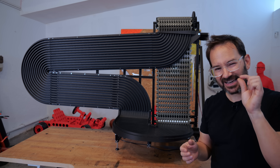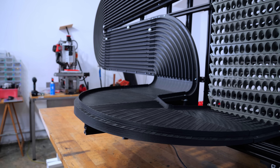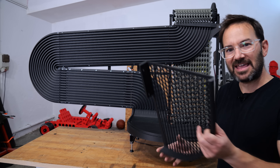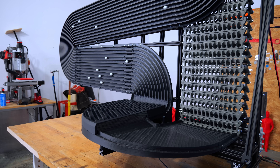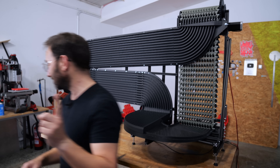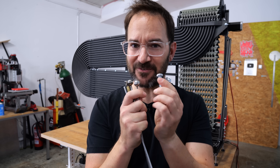I'm having a tiny issue at the end — the marbles come too fast down this ramp and jump over the little fence. So I printed a piece that goes there and should stop the marbles from escaping. That's it — a marble run that works first try, right? Not quite. I've been filing and sanding the marble paths for the last three days. I even made my own tools to file and sand the interior of the marble channels. It's been quite a workout.